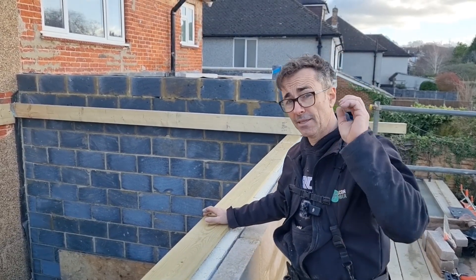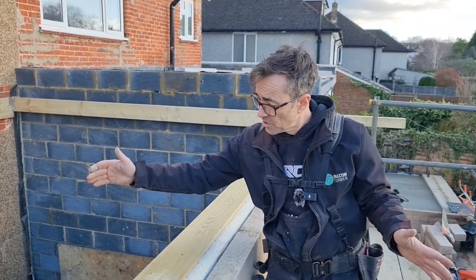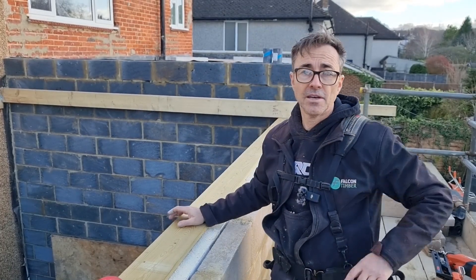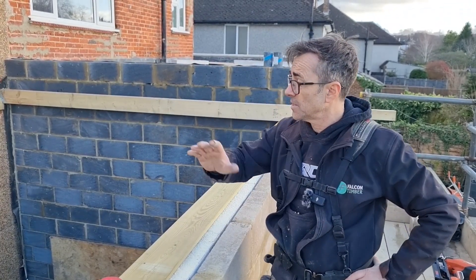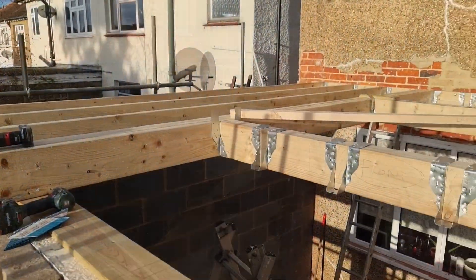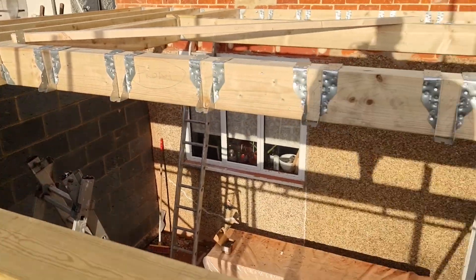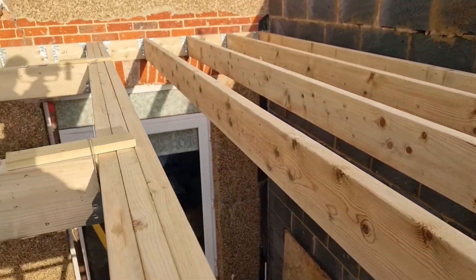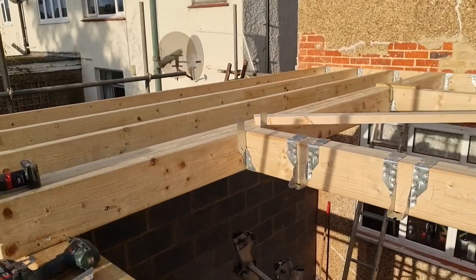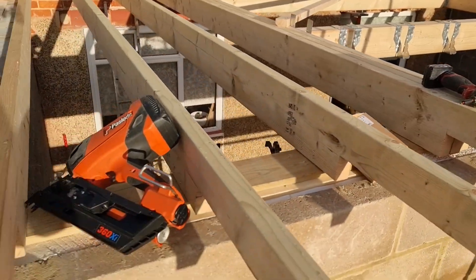All the work's been done down below — we've done all the cutting and setting out. Apart from making the front joists and the back joists to length, they've already got the end on. We've got all the trimming in, it's braced up, and we're just putting the long joists in. Ed's just cutting the front joists — we've got a set of solid bridging or noggings to go through the mid-span and on the other side. Once you've got everything set out and cut, it's just a matter of firing them in.